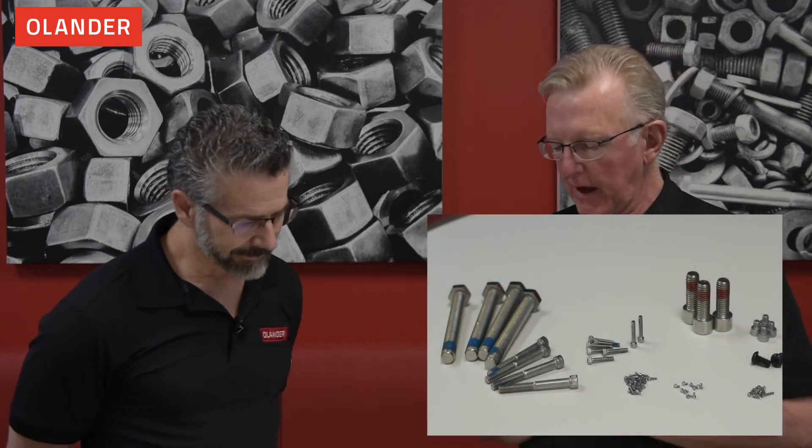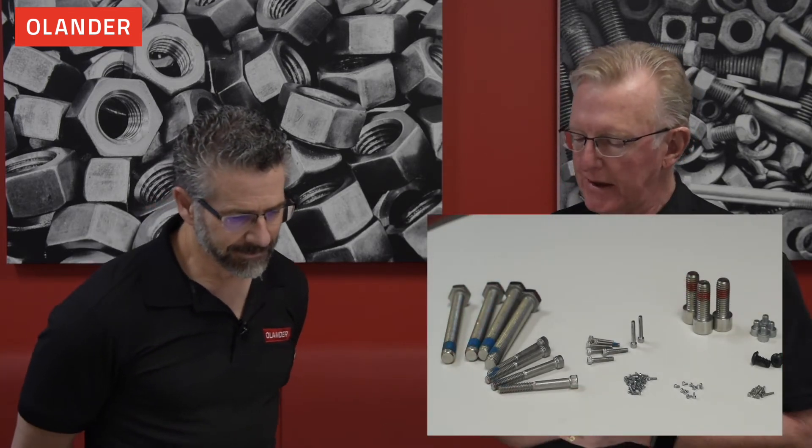Your on torque and vibration resistance is reduced each time you put the fastener in place. So why would I use a microencapsulated part versus a nylon patch? A microencapsulated part lends itself more to smaller fasteners with very fine threads where you're possibly using very small electric tools to install, maybe in very tiny electronics. It lessens the amount of torque necessary to drive the fastener in, and it's only going to activate once the fastener is in place and that epoxy is mixed and released. You could use a patch, but you might run into trouble with your drive systems if they're not robust enough to handle the additional on torque. There is also an option of a light patch that can sometimes mitigate those situations.